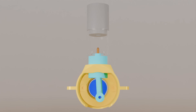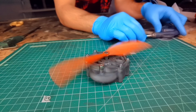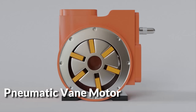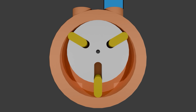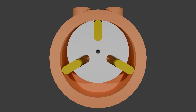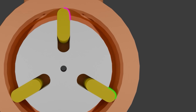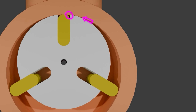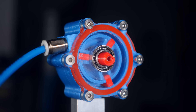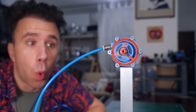The main problem with the crank-piston design is that it has to turn linear movement into rotational movement. A better solution would be a design that from the beginning produces rotational movement. After doing some research, I found something called a pneumatic vane motor — basically a rotational piston design, like if you morph the piston into a circle. The air comes in, pushes the vane, and that makes the engine rotate. I 3D printed this engine based on a picture I saw online, gave it a go, and it works pretty well — it spins pretty fast, exactly as it should in theory.